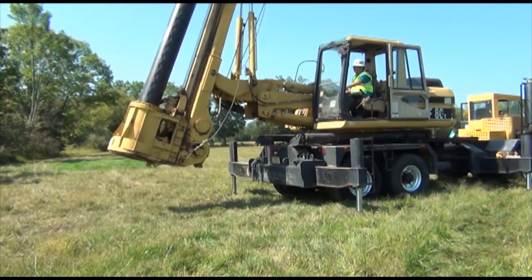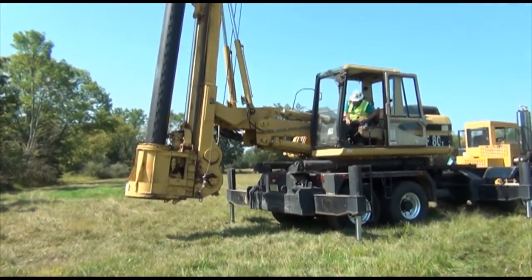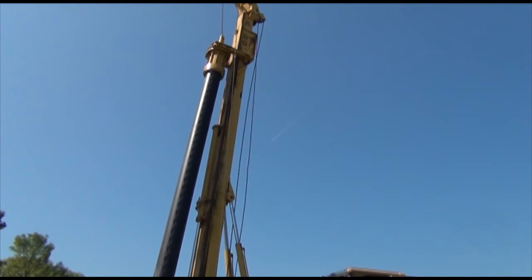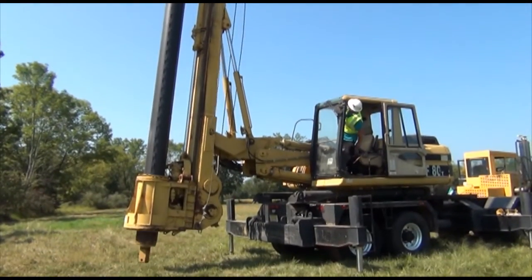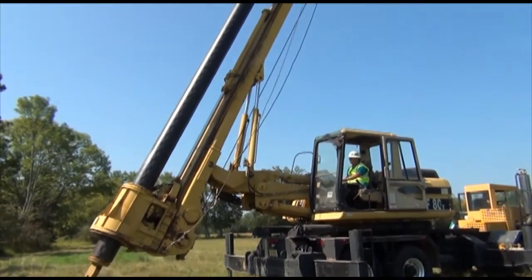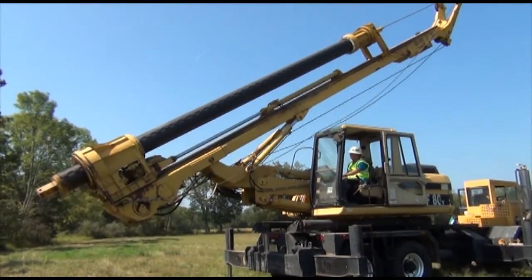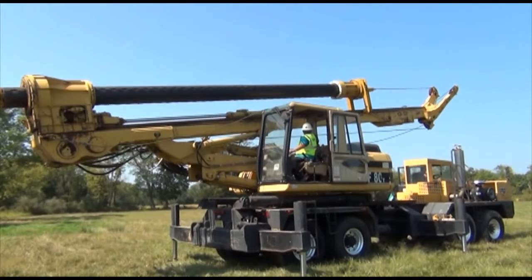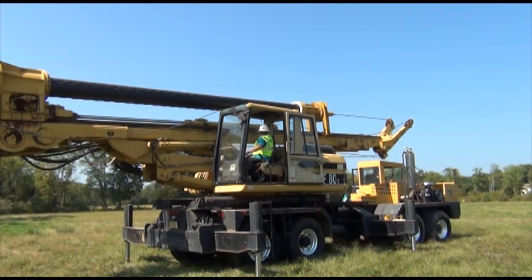In setup, you have to raise the tower up twice. When you tear down, you only have to lower the tower back down on rest and remove the guides, as you'll see in the picture at teardown. The Kelly bars in it are new, 3-element. There is no swivel or any hydraulic or electric lines going through the turntable in this machine, which makes it nice.